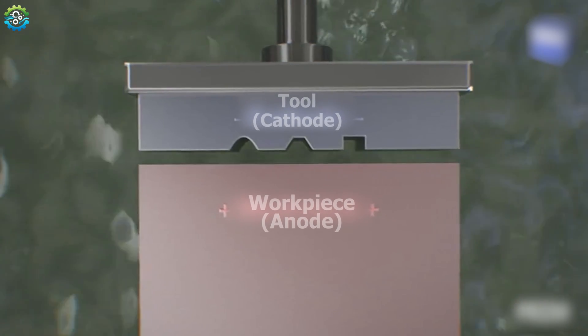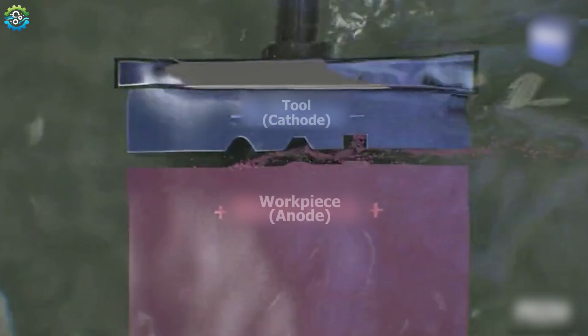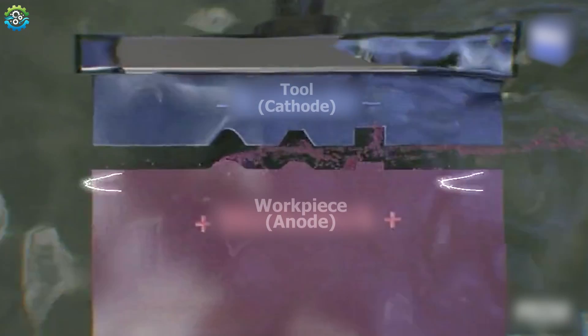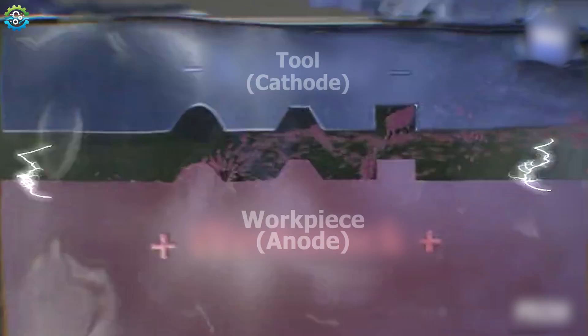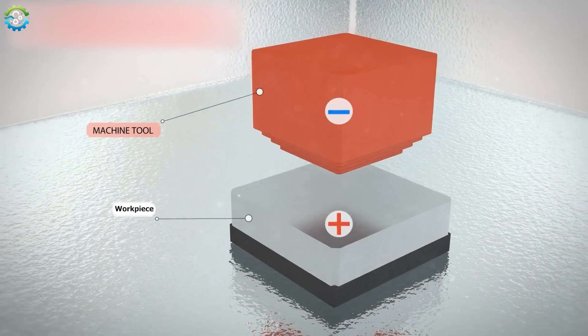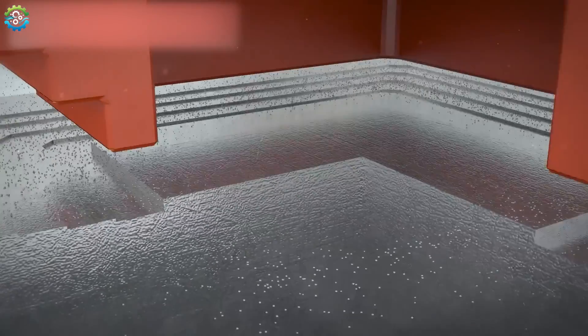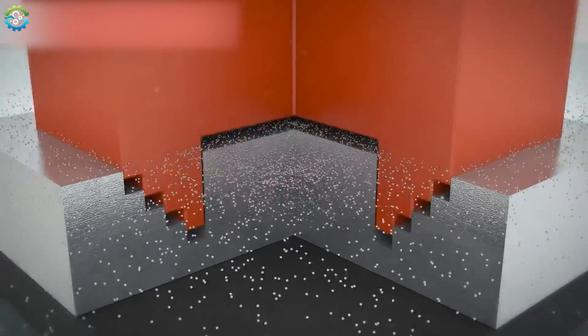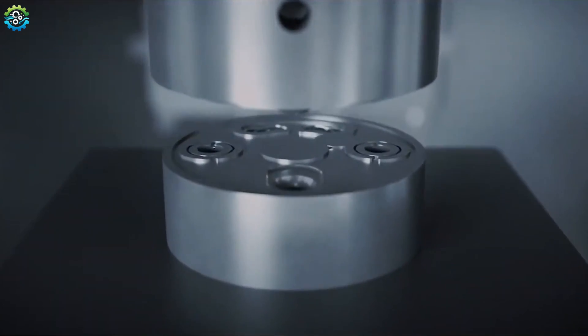The tool is usually made of copper, brass or stainless steel, shaped to the desired form and discharges negative charge to the workpiece. The electrolyte is a conductive fluid that allows the flow of current between the workpiece anode and the tool cathode. This current flow is essential for the electrochemical reaction that dissolves material from the workpiece. When high amperage and low voltage DC power is applied, metal ions are dissolved from the workpiece surface. The electrolyte carries and flushes away dissolved material, preventing it from depositing on the tool or workpiece. The precision and accuracy of ECM is more excellent than EDM, producing very smooth surfaces with no thermal stress.